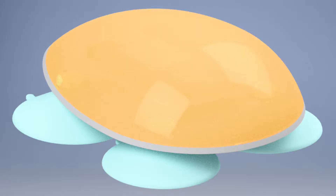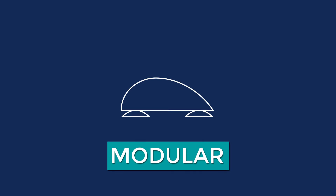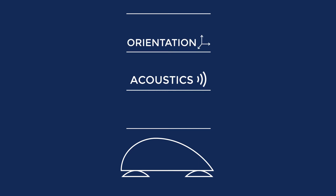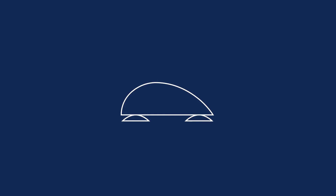The first tag is completely wireless — wireless charging and wireless data offload. Another big component of this project is that the tag is modular. We've got a base unit and from that we can add different layers, whether it be acoustics, IMU — that's orientation of the animal — a whole wide variety of things. This allows us to cut costs because we don't have a tag that has all of these different expensive sensors on it.